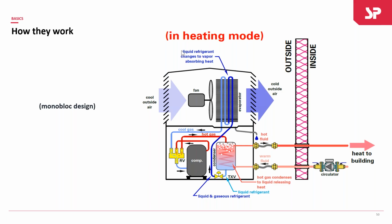Generally speaking, I'm going to say this multiple times, so I'll start planting the seed now. We target a water delta, that's temperature differential from the inlet to outlet water ports, of 10 degrees or less at maximum compressor capacity or system output, okay?